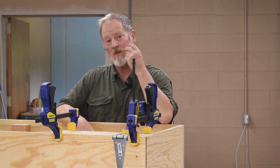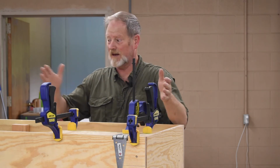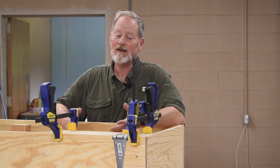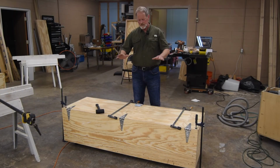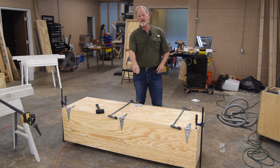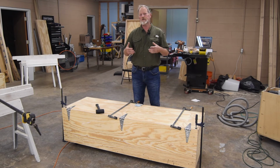So keep that in mind when you build your frames around these things, is that you want your hinges in 3 places to help keep this plate flat, and one of them is as close to that edge as you can get, and you don't want your frames getting in the way. The top is laid in, and I've got a 1/16 inch clearance front to back, but what I've tried to do is close that off because I want to be tight against the back when I drill these holes, so if there's any movement, we're good on that.